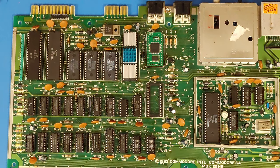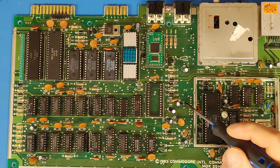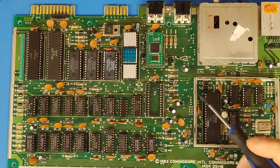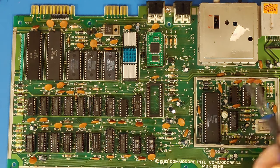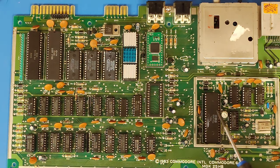I have been going over this board and found a couple of things that piqued my interest. The first one being right here, C12. C12 is supposed to have a 0.1 microfarad capacitor in it, and it looks like it's got a 10 microfarad electrolytic capacitor in it, when it's supposed to be a ceramic. So I will change that — I don't know if that's going to make a difference, I think it's just a bleed-off circuit, but we'll see.